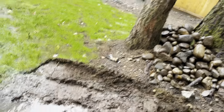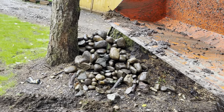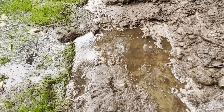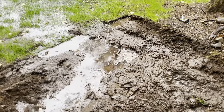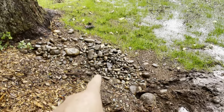Maybe I could put some drainage rocks. I'll leave it like that — it's not disturbed too badly and the grass is fine. The grass line is supposed to be here anyway. It's running pretty good. I can see it running down in here. This pit I'm standing on spans about 10 feet in diameter and I say 10 feet deep — maybe more like 6 feet. It was deep, a massive hole. There's 5 yards of 1.5-inch drainage rock in there. On top I put some big rocks, then carefully covered it with dirt, so the dirt layer isn't very thick.